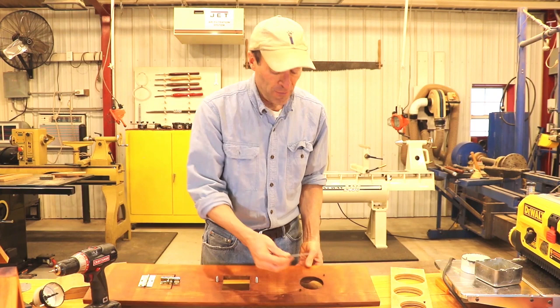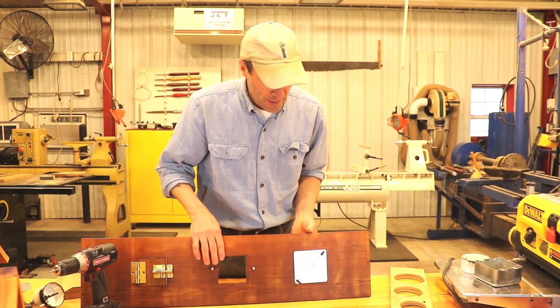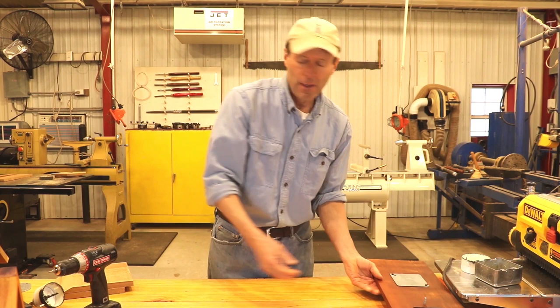In this case I've got a much larger cover from a metal junction box. If you take a look at it, it's got a little slot at the bottom and at the top it's got a bigger hole with a slot. I can simply press it in — you want to make sure this is the top and that's the bottom, because if you flip it, it would actually fall off. You just go through the bigger slot, slide it down, and tighten the screws up.